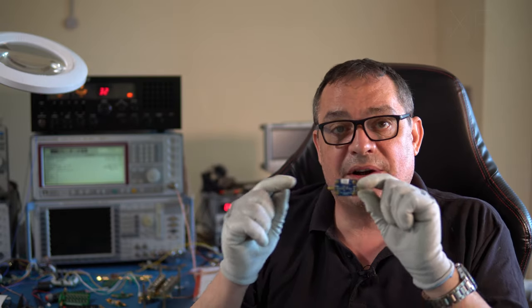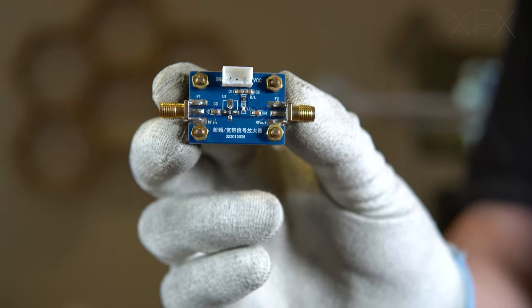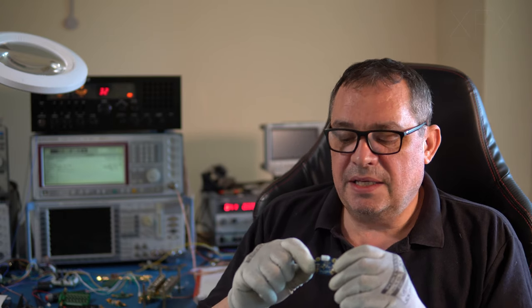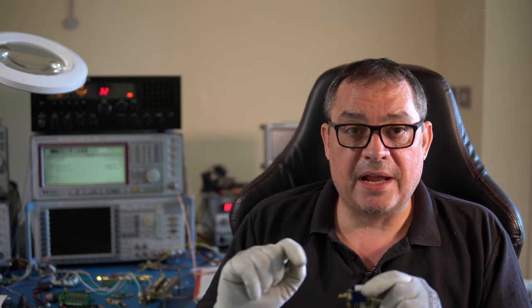So, if we have a look at RF amplifiers, again, we can go with modules, it's all standardized impedance, 50 ohms in, 50 ohms out. Now this one uses a little MMIC device. It's nice and linear, it's low noise, and we've got a range from 100 kilohertz to 2 gigahertz, I believe. Now the operating voltage of this is set by the people who supplied it at 9 volts, but to be honest, I wouldn't give it 9 volts. The datasheet says maximum 8 for that device. That's a little Hewlett-Packard device. I'll leave a link in the description.